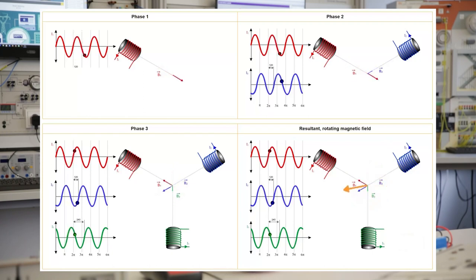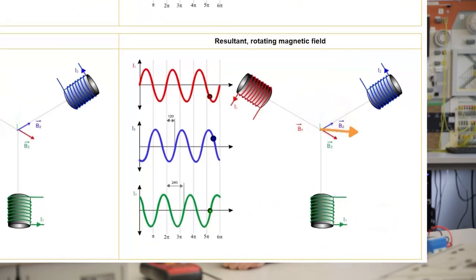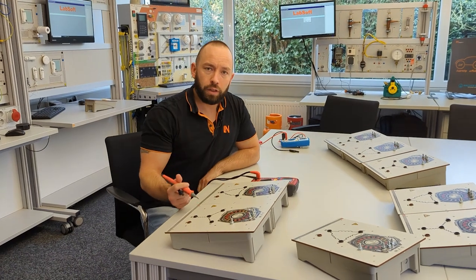In this animation you can see how the electric motor works — more or less how the rotating magnetic field is created within the stator through the three different coils controlled by the inverter. All three coils have the same sine voltage amplitude but with a phase shift; the first, second, and third coils are always offset by 120 degrees, so everything together makes 360 degrees. This rotating field attacks the rotor and causes it to spin. It doesn't matter whether it's a synchronous or asynchronous rotor — the stator always works the same way.